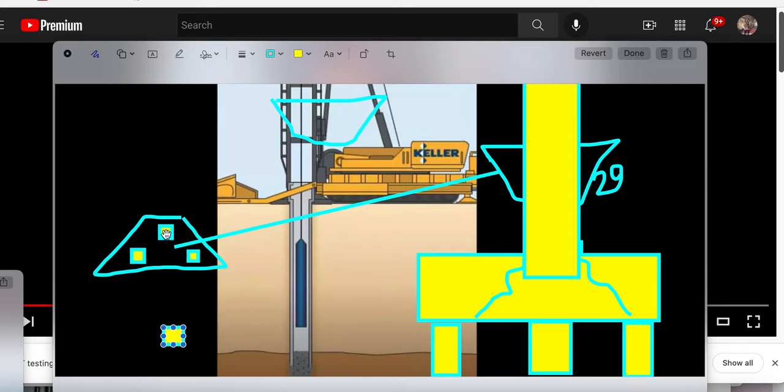They do the three of them to make it nice and stable — they figure out which one has the best resistance — and they put the column over top of the best one. And that's what they did. Then, testing — they were testing this straight down on one pier. They make a pier cap which goes across all three of these — it looks like that, roughly, a triangle shape — and then pretty much center-line of those three, on top of the pier cap with the rebar sticking up, goes the column.